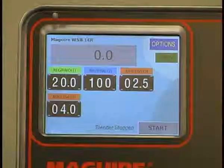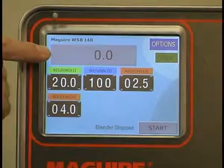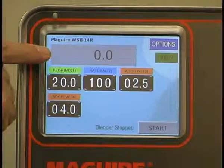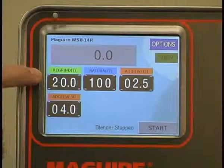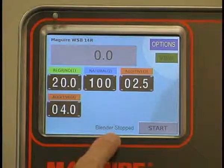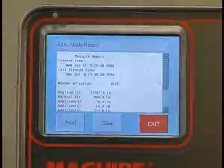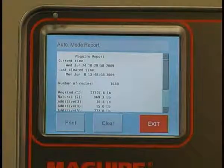Here with the layout of the screen, in the upper left-hand corner we show the model that is currently being operated. This is a display of the accumulated weight totals that, as the blender is processing materials, will display that weight as it accumulates as we build a batch. Here are the percentage entry screens for the materials, as I previously described. Down here we show the blender condition — in this case the blender has stopped. We have a start-stop button. And up here in the upper right we have a view key. I'll press that view key, and up comes totals of material processed by the blender — a very handy screen if you want to track actual material consumption.